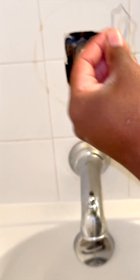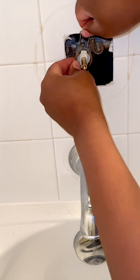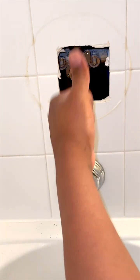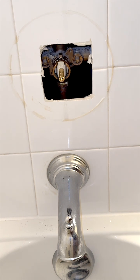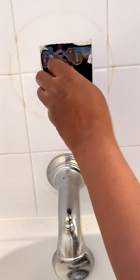Don't forget the fastener. The fastener is this little metal piece right here, and this goes over the top and down into the sides of the actual cartridge. This does not go over the entire pipe — it goes inside. You will see where the insertion belongs and it will insert there. It can be a little painful and annoying if you can't find the holes, but if you forget it, it makes for a very bad day and possibly another hundred-something dollars back to your plumber.